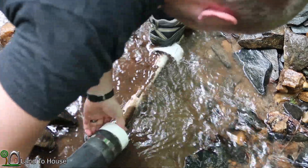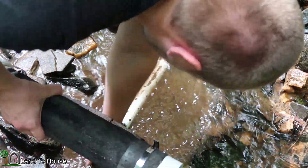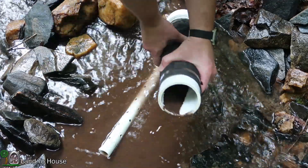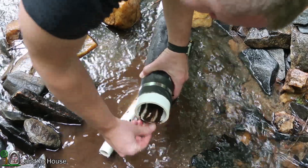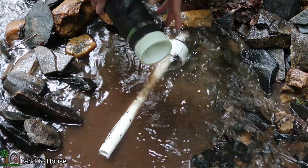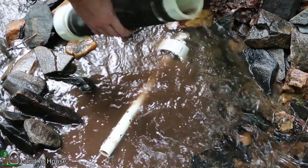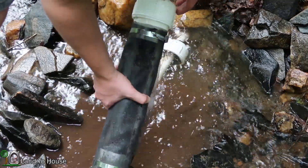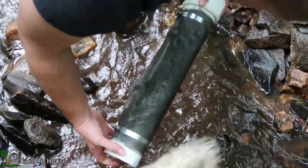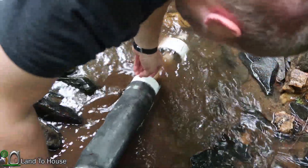There we go. This seems to be doing quite well keeping the flow rate up. There's a little bit of silt inside from what I can tell — very fine stuff, which is exactly what I was hoping. It's passing all of the big sand, leaves, and sticks and just capturing really fine stuff. This is a very valid means of a ram pump intake. I'll wash all this out, put it back, and let it keep doing its thing so we can move on to the new bucket intake.